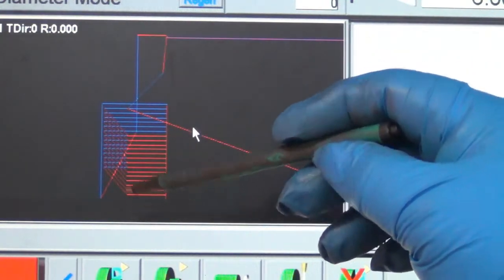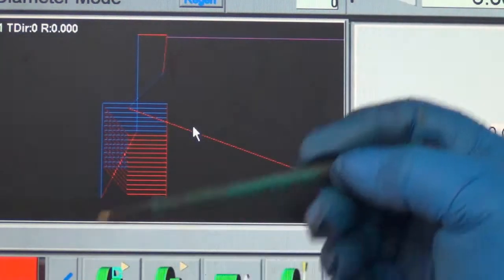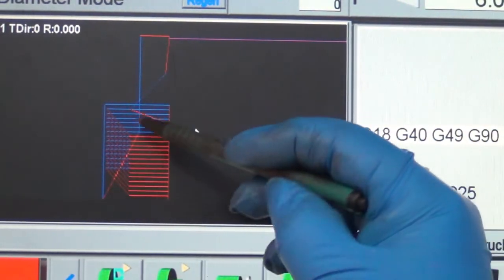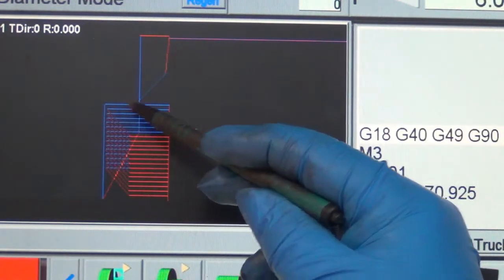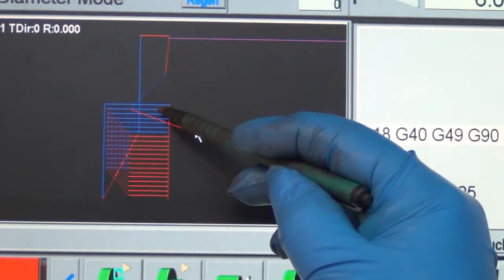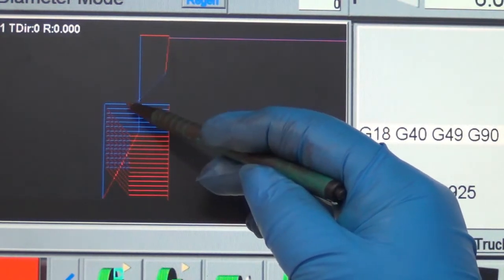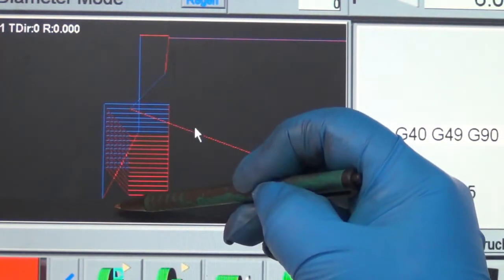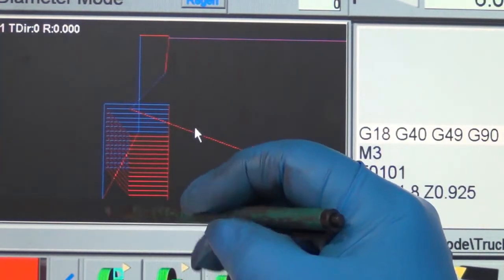I changed up — this is the bracket spacer doing the second side. What I did here was I got rid of that light pass, that light cut that went up here and then went back, then did the final cut. So what it does now is the final diameter cut for the boss comes in and then it just faces. I simply eliminated one cut out of there.